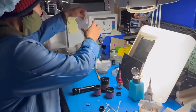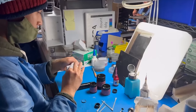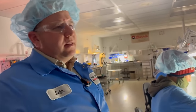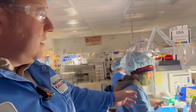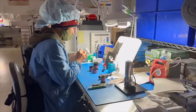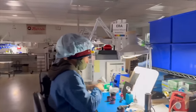She's making sure it's clean. We've turned off all of the overhead lights. That allows us to really see very clearly any sort of dust, any speck of debris. They're seeing pieces of debris that are 5 microns in size or whatever. And this is a component that's going to get buried inside the rifle scope. So getting access to it later means— It's too late. It's almost a full teardown. A lot more work to tear it apart.